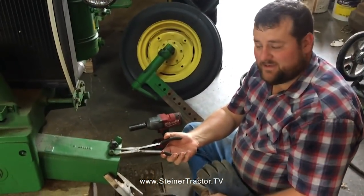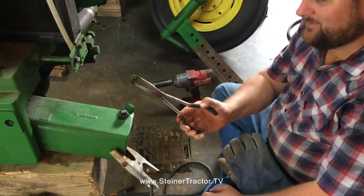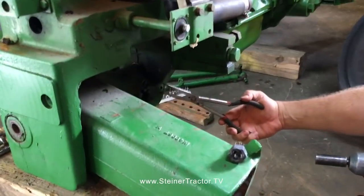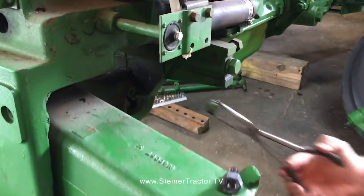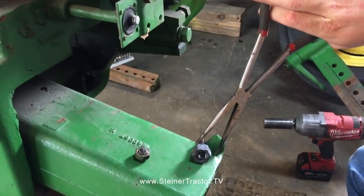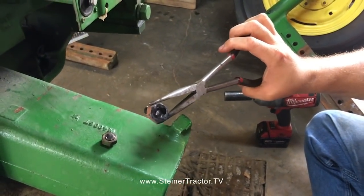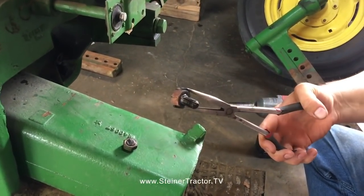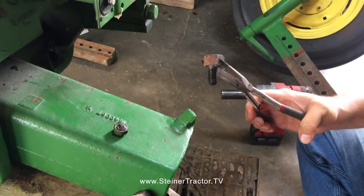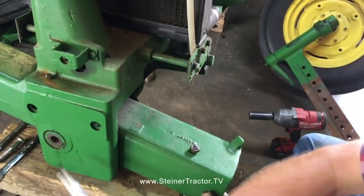So when we went to take the main axle tube out of the housing to replace bushings, we found out that there's a little retainer on the rear pin. It's in that center housing, right about like so, if you can see that. But it had been broken for a long time, almost flush with the housing. Well, the good old weld-the-nut-to-the-stud trick worked. I took a 3/4 or 5/8 hex nut and welded it to the end of this with quite a bit of heat, and it came out on the first try. Got lucky this time. Whoops, don't want to drop that hot thing.